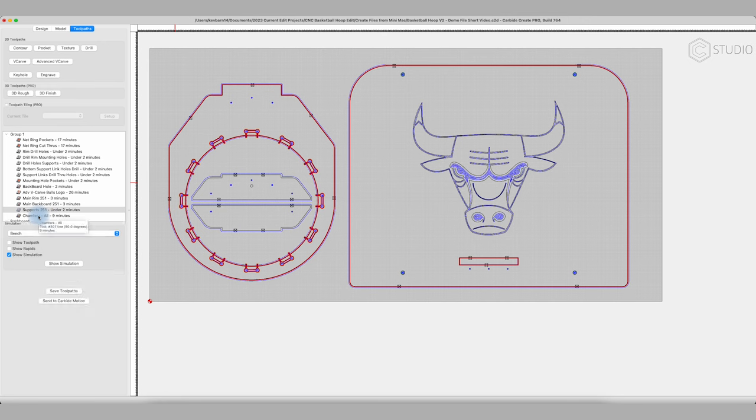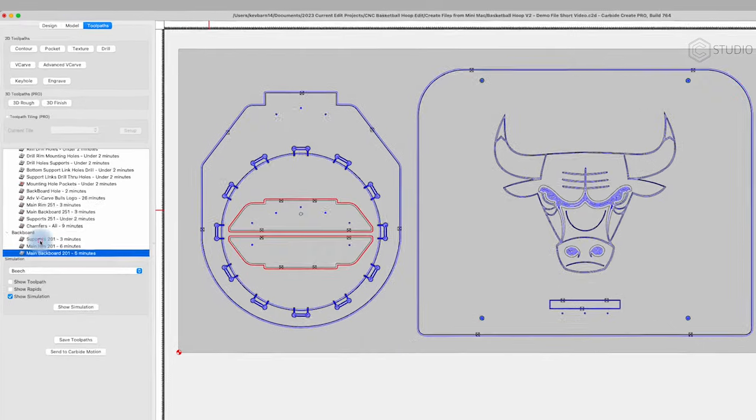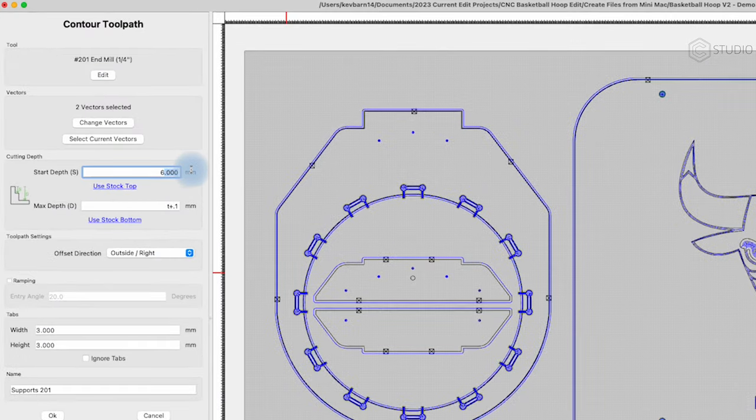And this allows me to chamfer when I have maximum strength with the parts. It's not held on by tabs after being completely cut out. It also prevents the V-bit from having to cut a fresh line. The bit chamfers the edge we want while running in the groove created by the 251 downcut. With the chamfers complete, I'm going to come back with the 201 upcut to cut everything out completely. Each one of those full cutouts will begin at 6 millimeters from our previous cut with the 251 and go to T plus 0.1 millimeters to be sure and cut through all of our stock.